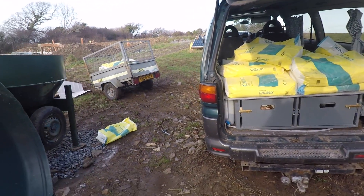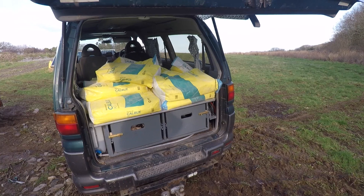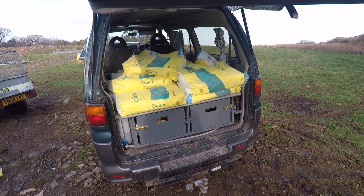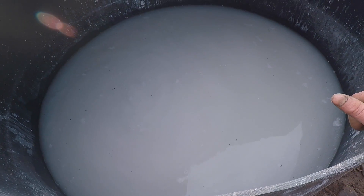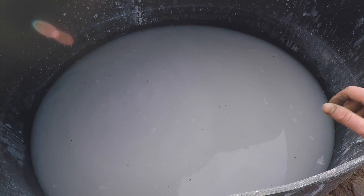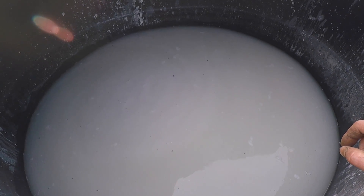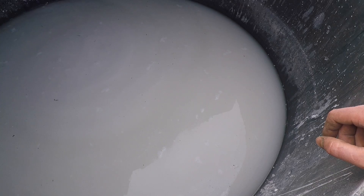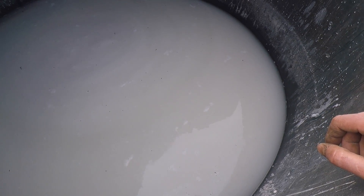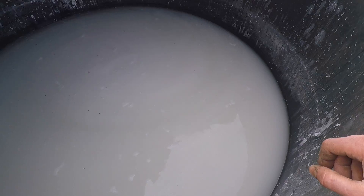I just picked up lime — I had one of them split so I quickly put it in. I want to try and get this unloaded and slaked because a friend of my girlfriend needs my van back. We're going to add it into this water here and it's going to slake — chemically react, heat up the water, and turn into lime putty, which we'll leave for a long time to mature. This stuff is incredibly caustic, so I'm going to wrap my face in cloth. I haven't got a respirator but cloth will be fine — I'll stay away from the dust clouds, and I've got eye protection too.